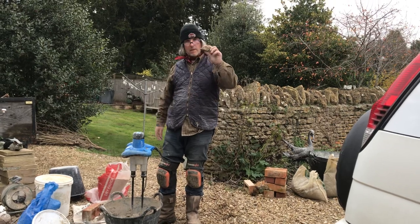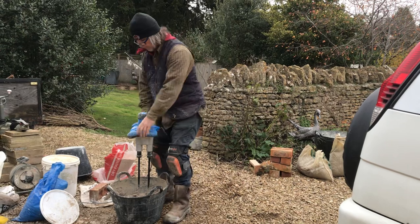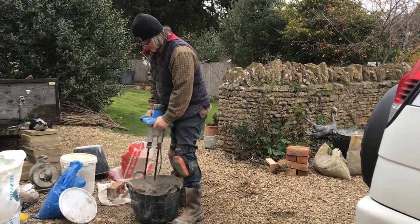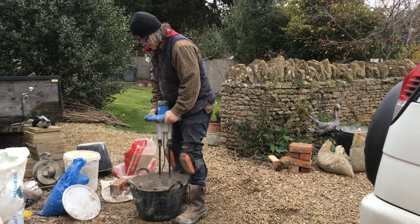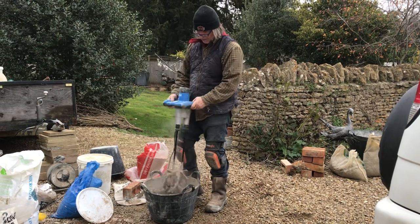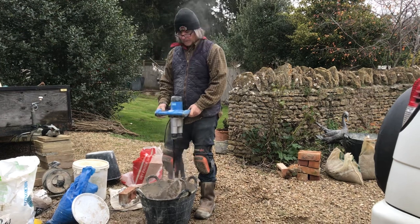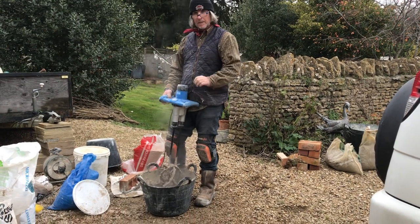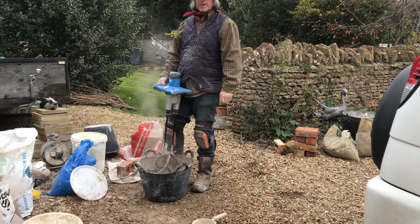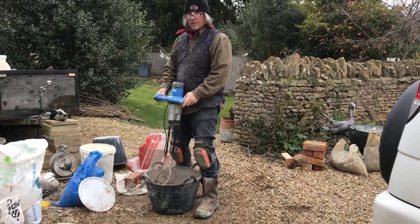Here's a little bit of galleting stone, because at the end of the day, you'll be filling your holes as you go. I'll give it one more go. I've also got a drill around the corner, and when it stiffens up, which it will because of the amount of free lime, I'll whiz it up with maybe a little bit of water, because it's losing moisture with the steam, you see. So that helps it to stiffen up. Throw that in.